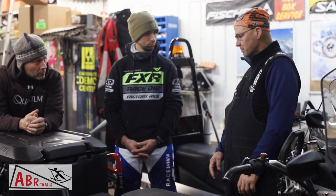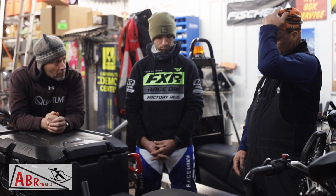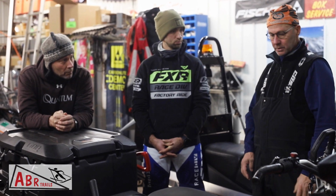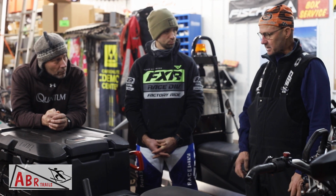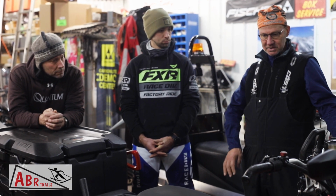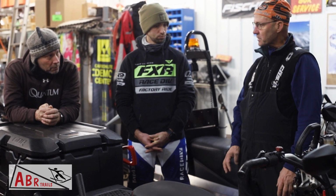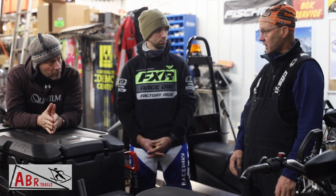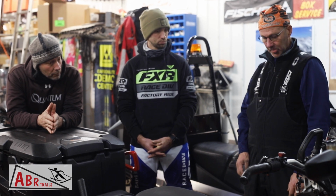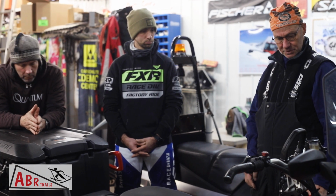And if it's super slippery, then we need some ballast on the back. So one of us jumps on the back to weight it. They're adjusted for steering. So basically, you've got more weight up on the skis and the carbides, which is great for steering with a load, but it's hard to get traction until you put a groomer on. So once we're hooked up, we'll be hooking up outside.